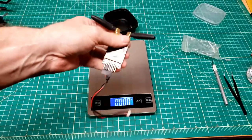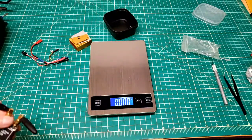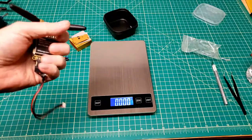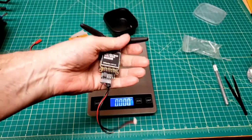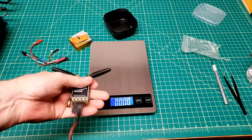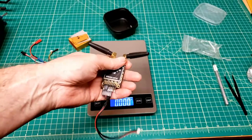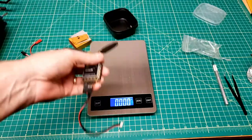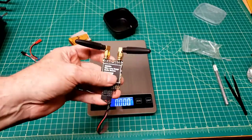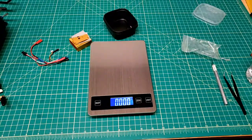Because there is a transmitter, you know, you can turn on a receiver all day long without an antenna on it. It's not going to hurt it. It's just not going to receive on the frequency that it's supposed to very well without a tuned antenna on the input. But there's not a pseudo-electrical component to it that's part of the first input on a receiver. That input's just sitting there looking for a little voltage on what it's expecting to receive, and if it finds it, it starts amplifying it, and off you go to the races. If it doesn't get anything in, it thinks, okay, I just don't have a signal. But on the transmitter, it's totally different. So because things can be transceivers that you don't really suspect to be, just put an antenna on everything and you'll save yourself a lot of grief.